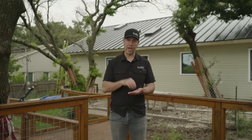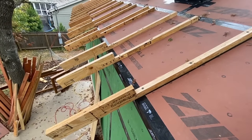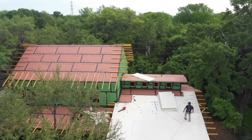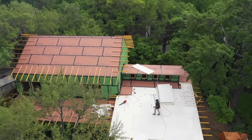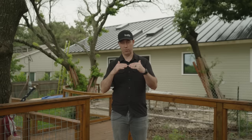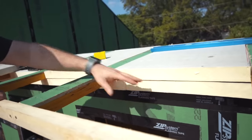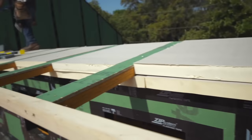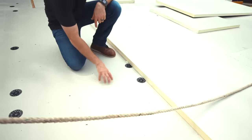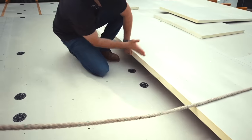The first layer goes down with cap fasteners, flush with those rafter tails I built, and the second layer covers over top those rafter tails — so when you look at it afterward, it looks like a full blanket of insulation. I could have done it in a single four-inch layer, but all poly iso foam has a little bit of shrinkage, which means you'd have a loss of insulation at the seams. So we run it in two layers — a two-inch layer first — and stagger the seams both horizontally and vertically for full-depth insulation.